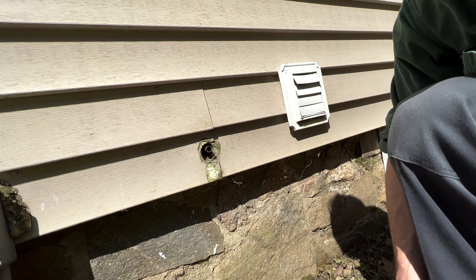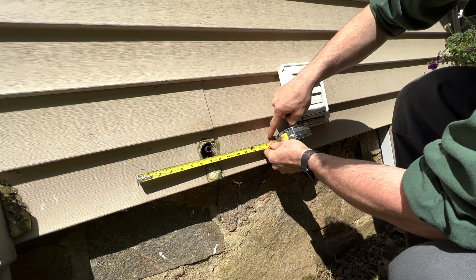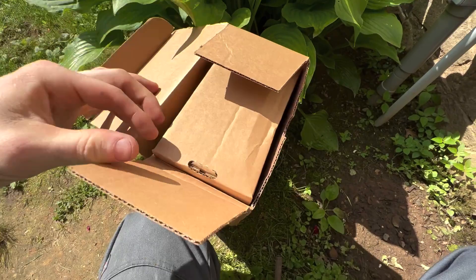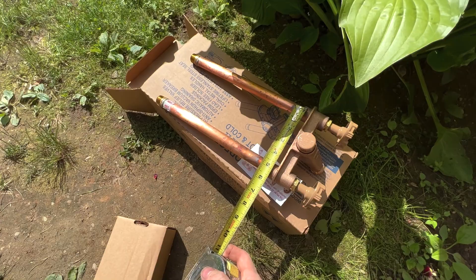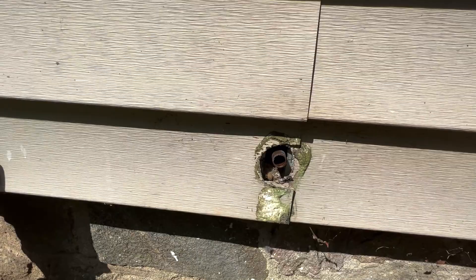While we're here, let's measure this out — we're seven inches over to this joist and seven and a half to the other, so we have a pretty decent span. We might be able to sneak it in one way or the other. Let's unpack the new faucet. There we go — our span is five inches, so we should actually be able to reuse this hole, just open it up a little and sneak it just past that joist. We'll go downstairs and double-check the measurement.